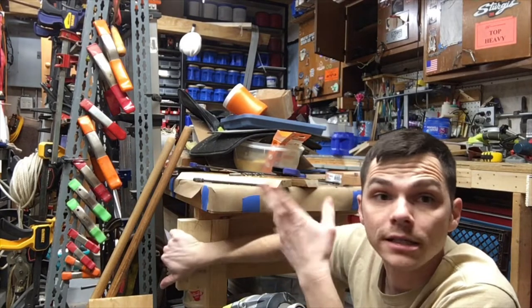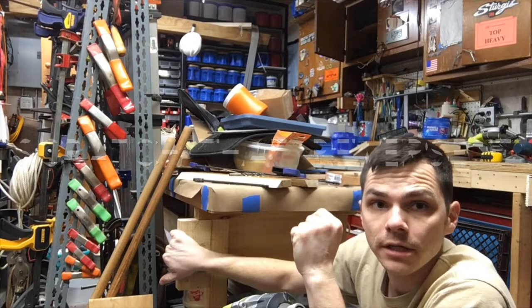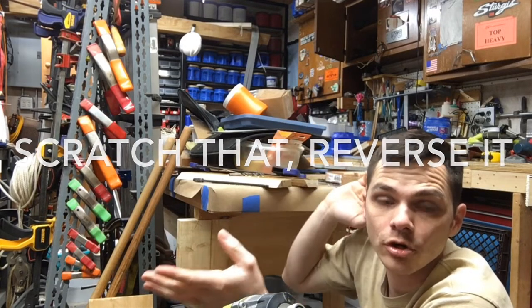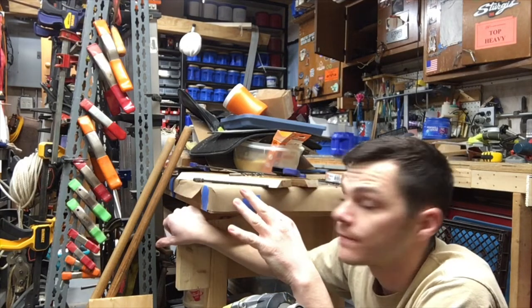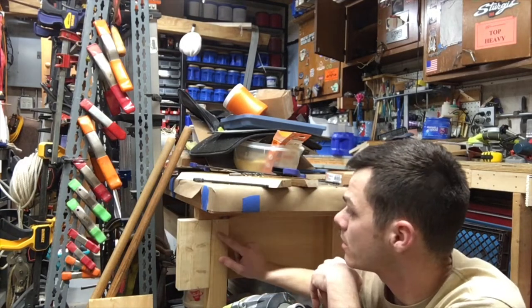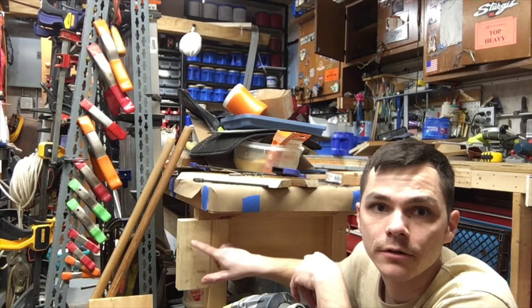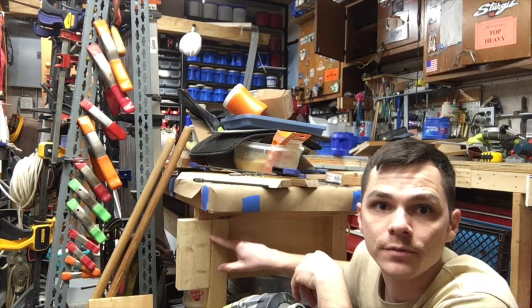So I got a couple quick thoughts here I just want to throw out there. One, it's a lot stronger than I thought it was gonna be. Two, nails are always stronger in a vertical position, and screws are always stronger in a horizontal position. Three, I did countersink and I made a relief hole. This part here has a wider hole than this part here. This part is just the shaft, this part is the shaft and the threads.